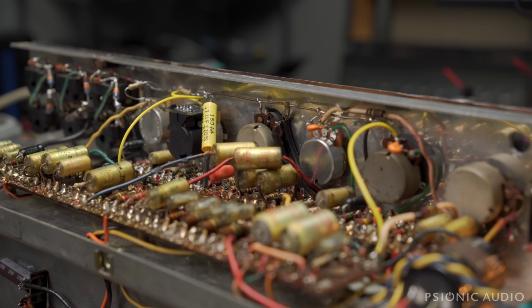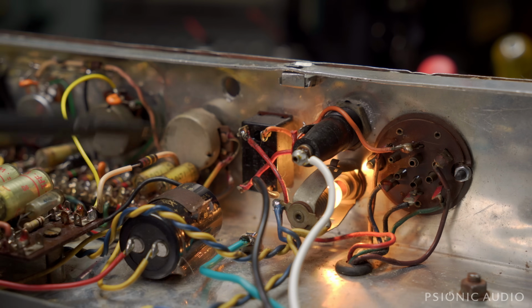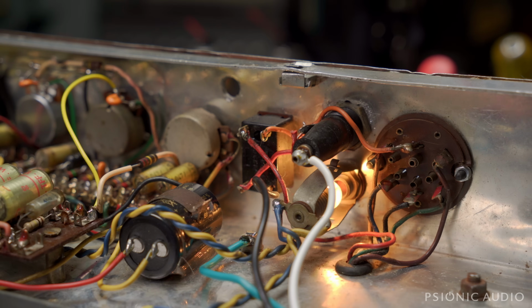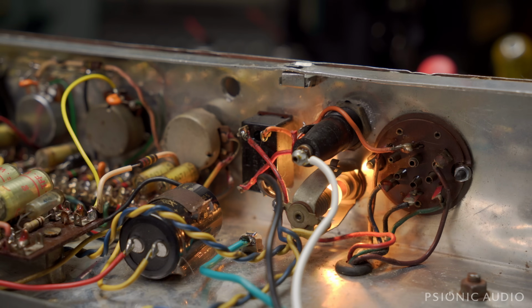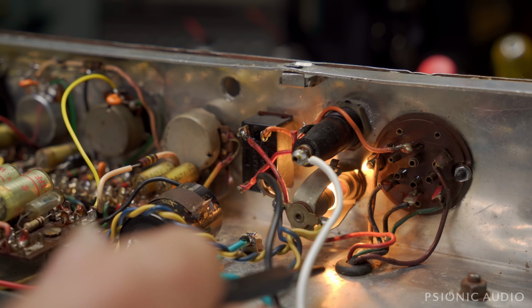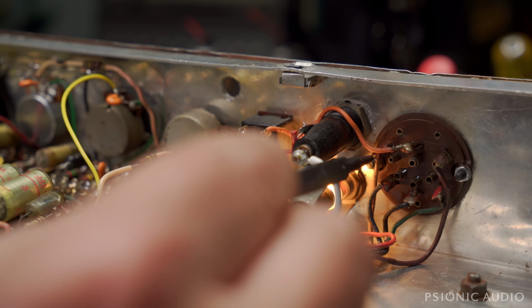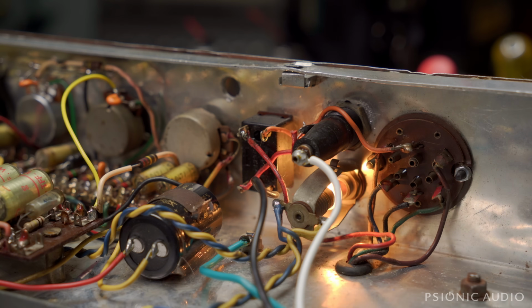Sounds more impressive with pedals turned on there. Anyway, the amp's sounding really promising. Next up, I'm going to find a way to plug this hole neatly. I'm going to replace the switch because it's physically kind of wearing out. And I'm going to redo the power cable connections to make it all pretty. And I'm going to hardwire this to 110, 115 rather than rely on that physical flimsy switch. All this has been approved by the owner.